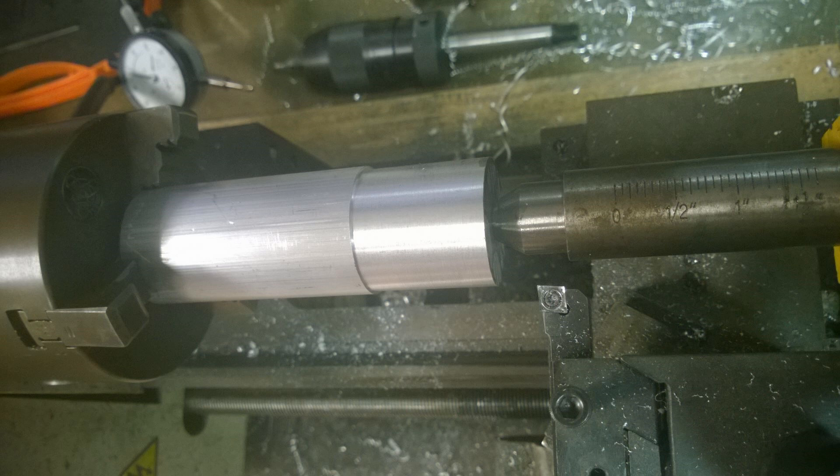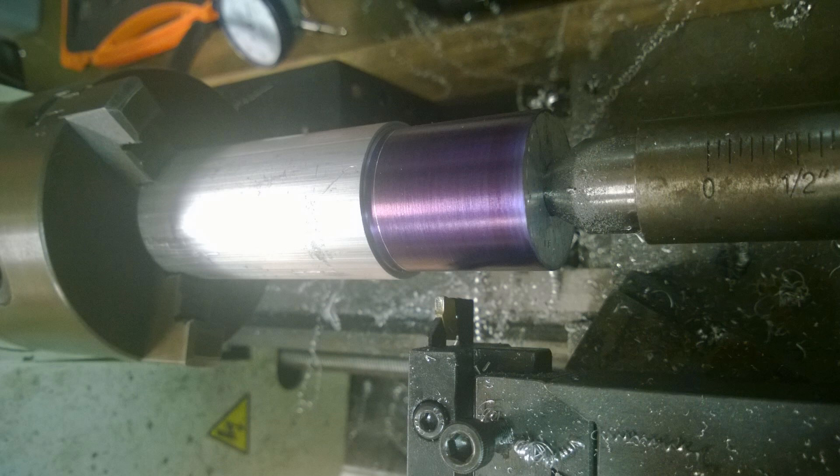This is part four — making the piston for our easy engine, our little two-stroke engine. I've got some 6061, the bog-standard extruded aluminum you get from anywhere. I was going to get some hypereutectic aluminum, something with a bit more silicon in it, but to be honest this engine is never really going to be pushed hard, so it's just a teaching exercise.